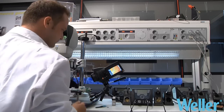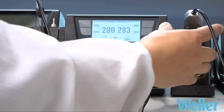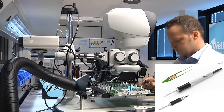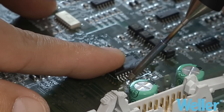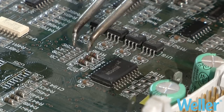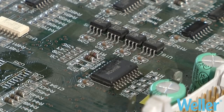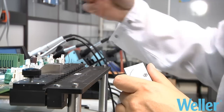Active tips are designed for micro electronic applications with high heat request and represent the fastest technology for heating and response. A micro tool is particularly useful under a microscope, and a micro tweezer is very useful to desolder passives or dual inline components, also with heavy ground connections.